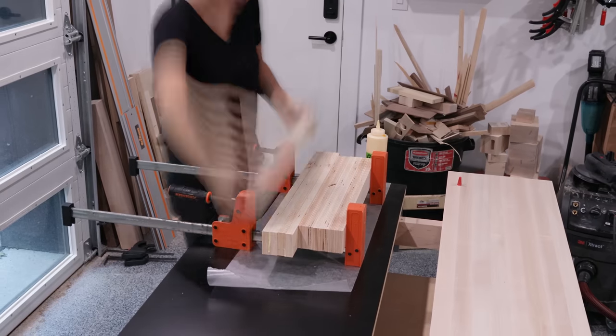The tail vise will have a dog that moves forward and backwards, so a notch needs to be created so it can slide. I made the notch by drilling two holes with a Forstner bit, adjusted the fence on my router table using the hole as a guide, then connected those two holes. The plate is held down with screws — make sure to countersink those holes so the screws sit well below the surface. I decided to use brass screws, but they're notorious for breaking in hardwoods. A little bit of screw wax and they go in super smooth. Now that the plate is held down, it can be flushed to the surface of the bench with a hand plane.